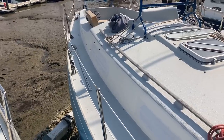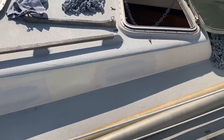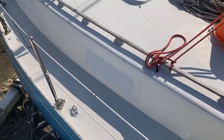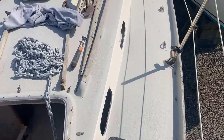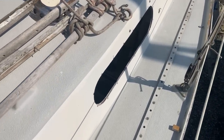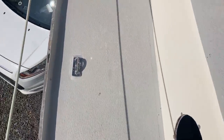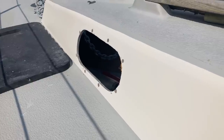It's now the next day, but this is how I left the boat yesterday — you can see all the windows have disappeared, they're all taped up with big thick white tape. The starboard side was completely finished and today I've been getting on with the port side. As you can see down the port side, there are the two forward windows all ready, there's the saloon window and there is the galley window. They have all been removed, cleaned, filled, sanded back, and I've wet sanded all around the outside so we have a nice clean gel coat.